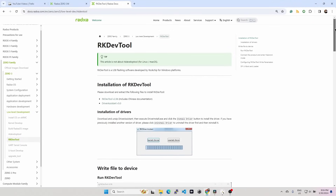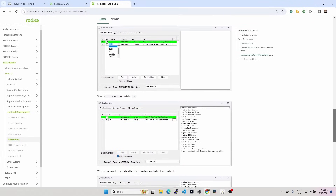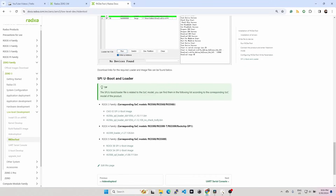Keep in mind that flashing an image to the onboard eMMC is not as easy as the SD card. It involves installing a driver, downloading a proprietary flasher utility, a bootloader file, and pressing a physical button on the board while you connect it to your computer. To be fair though, this is the case for most SBCs that have onboard eMMC — even the Raspberry Pi CM4 works in a similar fashion, so I won't ding them for that. 9 points it is. If you buy the eMMC version, you should know that going in.